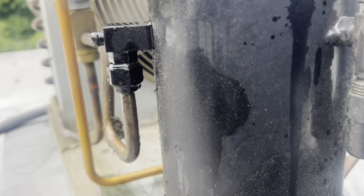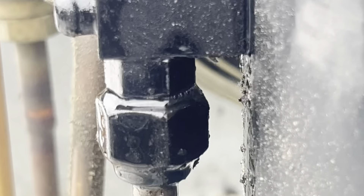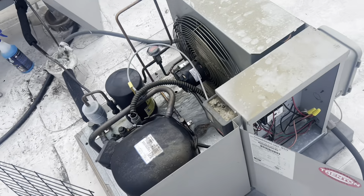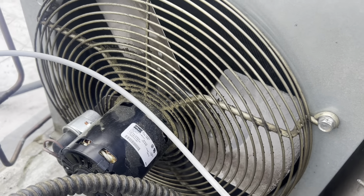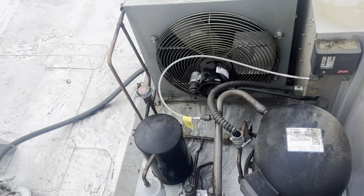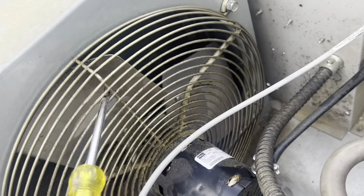It's actually going off on high pressure at the moment. When I try to spin it, it just locks up. We've got oil all over the back of the motor here. The motor's blown out its oil. With the fan blowing backwards, in theory, that may be the oil that's all over this — and it's not refrigerant. We'll see.